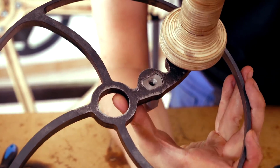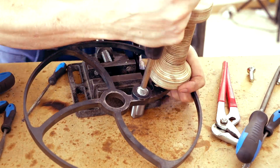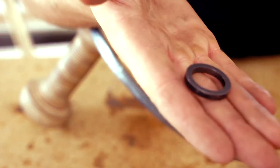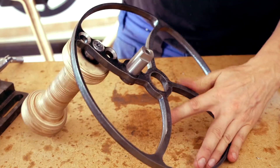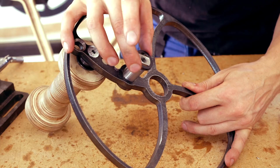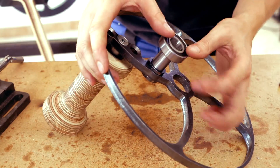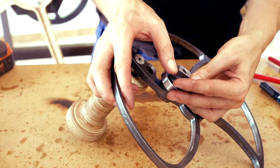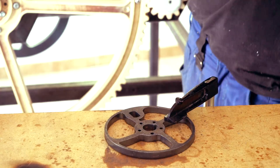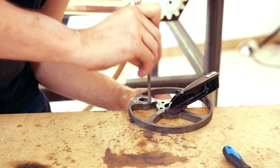Here I'm mounting the offset shaft, and the offset shaft also gets a custom washer on the outside. On the inside it gets a lot of spacer rings because they are later going to hold a bearing. This bearing sits on the offset shaft because of the treadle pedal — there will be a link going from the treadle pedal up to this bearing. It may look a little strange because it's offset 70mm from the center of the circle, but this will all make sense later when the treadle pedal gets into the picture.